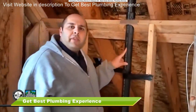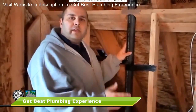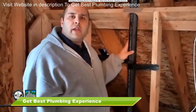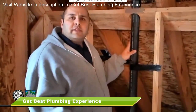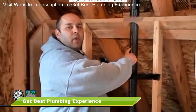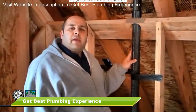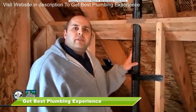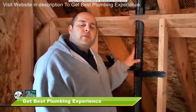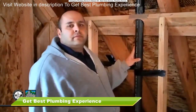The biggest thing about this is we have to have the same size cross-sectional area for our vents as we do for our required sewer. So for this residence, it requires a 3-inch sewer, so we have to make the same square inches in vent. So we've got to have 7.06 vent and 7.06 sewer. So we've got a 3-inch sewer, and we've got our cross-sectional area for our vents.